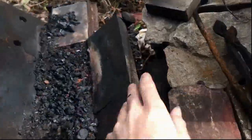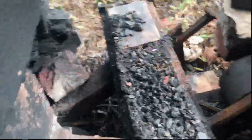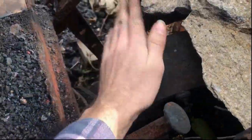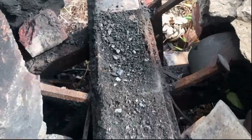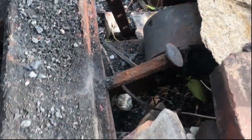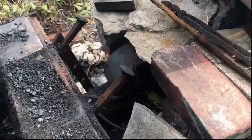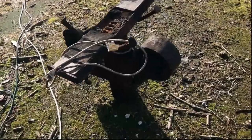Taking apart this fire trough assembly to see what the blower motors look like. It's not pretty down there. There's the original squirrel cage fan and the new one added which is much more powerful, but still only getting a tiny percentage of what either of them should provide because they're so filthy, with so many holes rusted in the assembly down there. The support across the back is basically falling out completely.